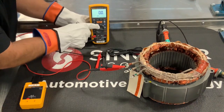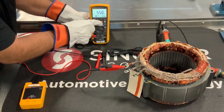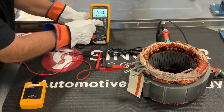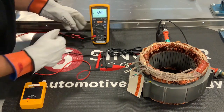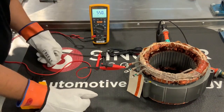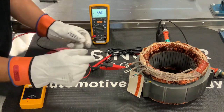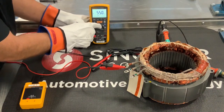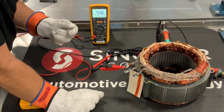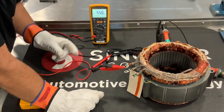We'll run this test — I'm going to hold the button. It shows the high side of my scale, meaning the resistance is at the absolute highest end for this test, and the voltage provided is 526. A couple of things: I like to use the clamps because I can leave them on. If you use regular leads, you always want to remember to release the test button before you disconnect from the component you're testing. The reason is, if you don't have gloves on, that's how you get to feel 500 volts, which I wouldn't recommend.